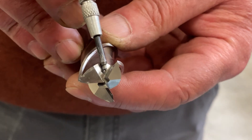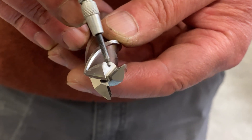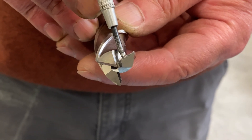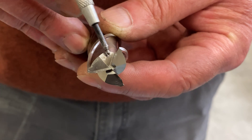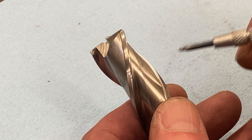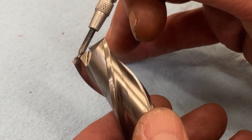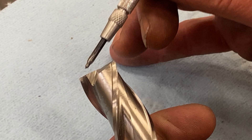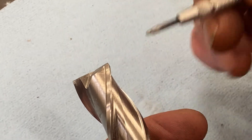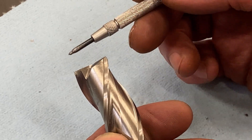The gash is this area here where material has been removed and it primarily does two things: creates a tooth face and provides clearance for chips to evacuate the cutting area. This end mill is in pretty decent shape generally but it has been through some sort of incident where it got some pretty decent chips on these corners, so the end needs to be repaired — that's what we're going through today.